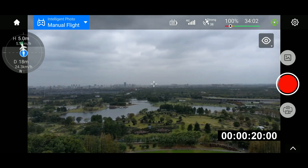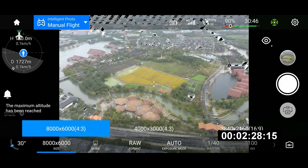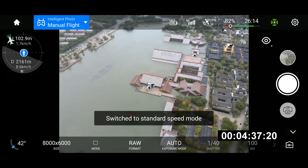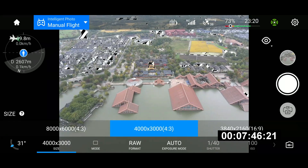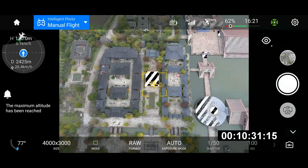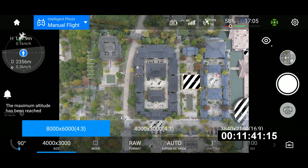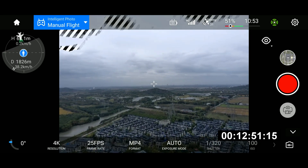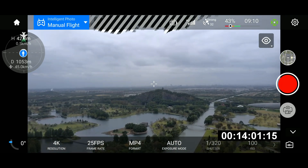Speaking of battery performance, let's see how well the battery holds up through a typical mission profile. We're taking off to do some photo reconnaissance of a site roughly 2km away — and winds today are really strong, you can see the artificial horizon jumping around as the drone's motors work very hard to maintain stability. With a fully charged battery, we achieved: a 2.5-minute flight with a tailwind towards the target, roughly 8.5 minutes of playtime reconnoitering the target, a 4-minute flight into headwinds back, while landing with 15% battery in reserve. I honestly expected more endurance, but we were flying in extreme wind conditions.